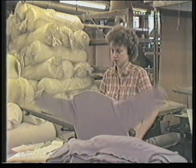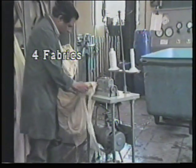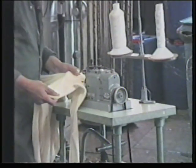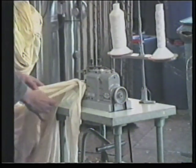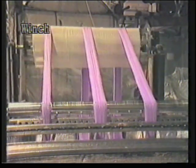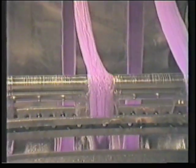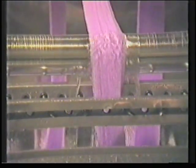And now to fabric processing. Because fabrics are made in long continuous strips, often up to 50 to 100 meters in length, the machinery needed is quite different to that used to process garments. The fabric is processed by sewing a number of knitted rolls together. The key elements of machine design for fabric are to obtain good uniform dye liquor penetration, to avoid surface change, and to minimize length pull on the fabric to limit subsequent washing shrinkage.